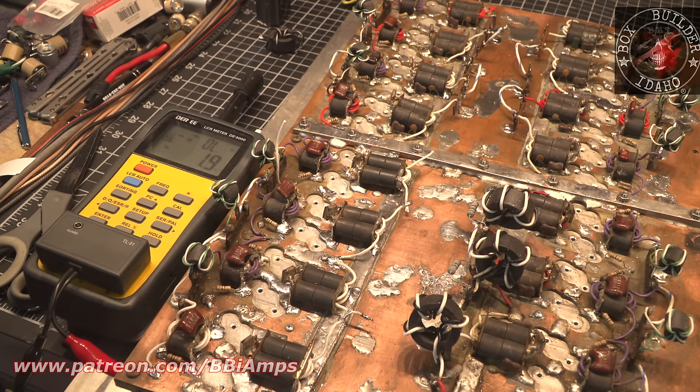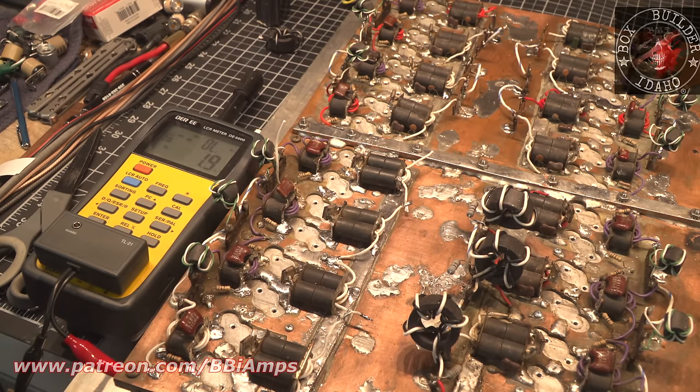There's a couple different factors that you got to look at: the thickness of the phenolic, the thickness of the material that you're using for the repair, how to go about setting the fiberglass back up. If the fiberglass has got a burnt hole in it, I'll tell you the type of resin that you need to inject into it to recreate an insulator, because if it's got carbon score in it, you got to remove all that carbon score, then inject the resin, then you can come back and lay a new trace of copper over it as long as it's the same thickness, because the thickness of the copper makes a huge difference as well. Okay, class is over.